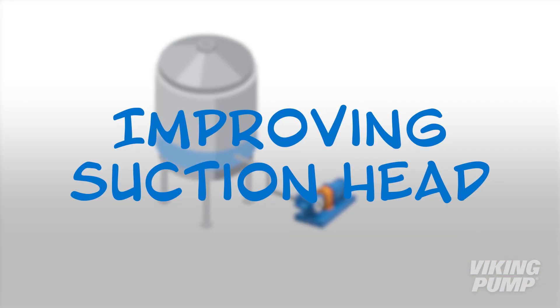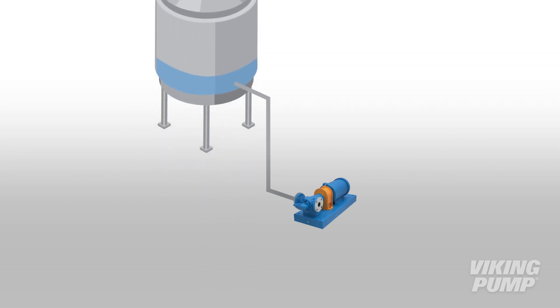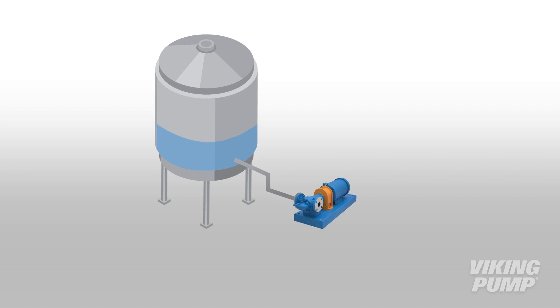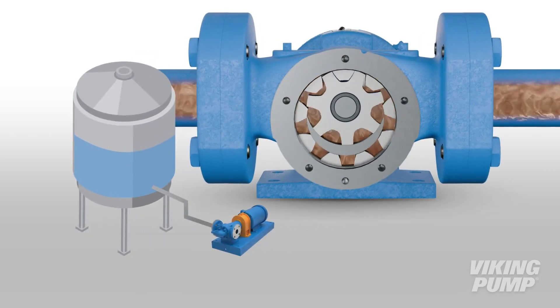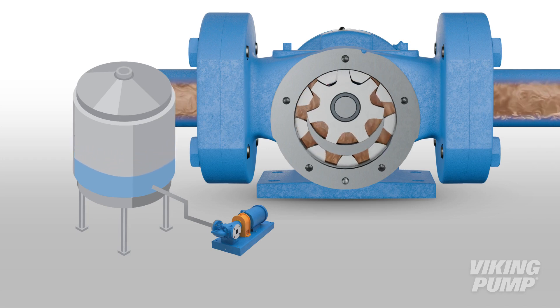For most systems, it starts with atmospheric pressure, but you can't move your entire facility to sea level. So what can you fix? The first is improving suction head. To improve suction head, we can either raise the tank or lower the pump. It would be more realistic just to keep a higher liquid level in the supply tank. If cavitation still persists at the lower level, consider slowing the pump as the tank empties to prevent this, but more on this later.